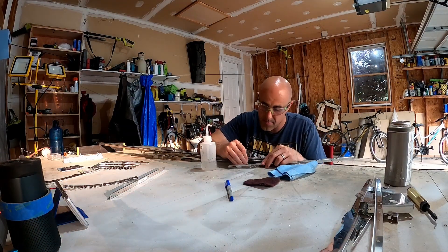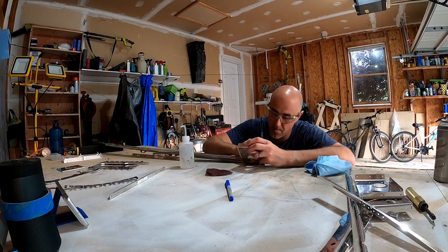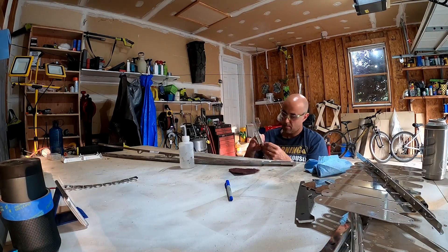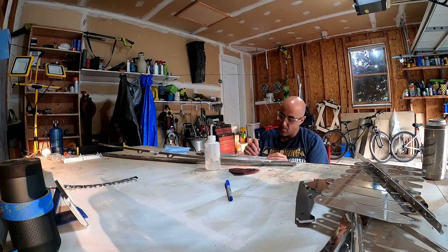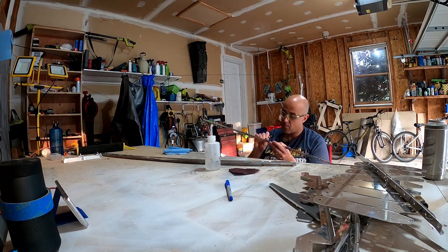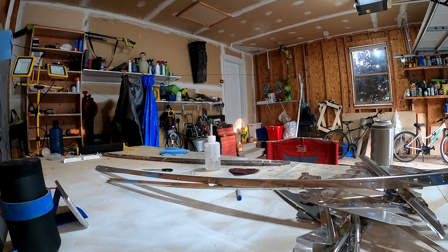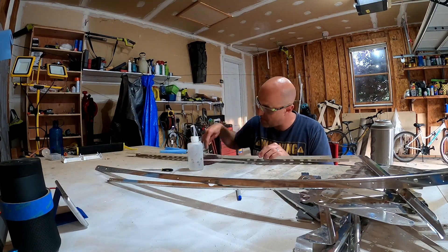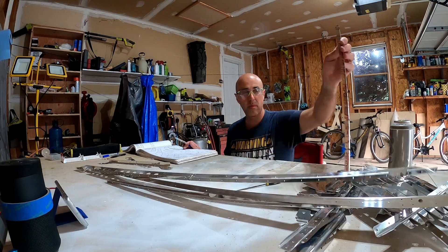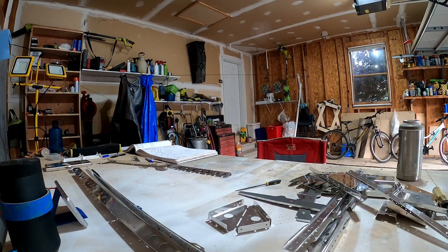This is more prep work and I'm seeing a reasonable amount of parts that are, I think, punched. Some of them are laser-cut. I hope some of them are punched. The one I got in my hand right there is not — that was laser-cut. This is parts prep for mostly the pieces that do the continuation from the last one. We're doing a lot of the prep work on the ribs and the sort of seat and rear portions of the substructure of the fuselage.